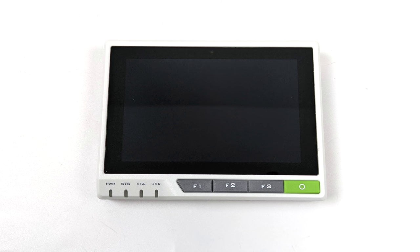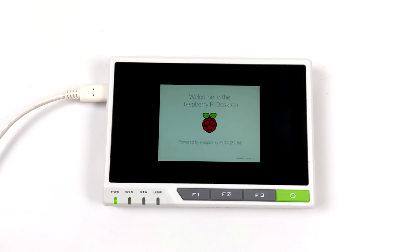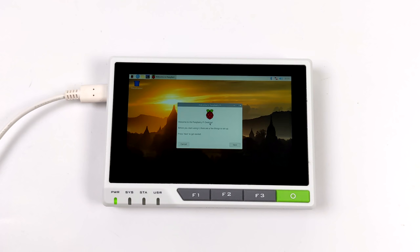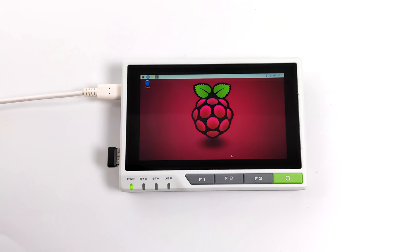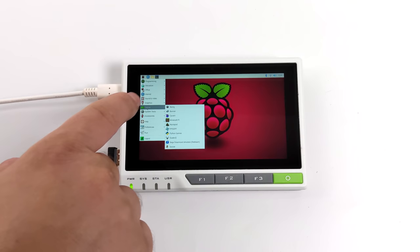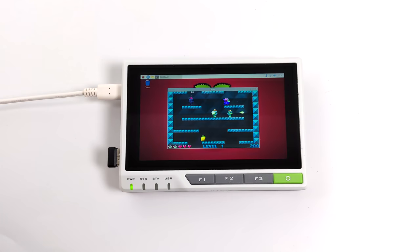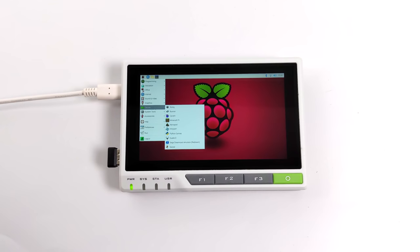On the front of the unit we have four physical buttons, and up top we also have a power button and four activity LEDs. I'm going to go ahead and boot this up for the first time using a 3-amp 5-volt power adapter — basically the standard Raspberry Pi 4 power adapter. The operating system is Raspberry Pi OS, but we can also install Ubuntu because all of the drivers that Seeed provides on their GitHub page will work with both. The touch worked right out of the box and it's actually pretty accurate for this little 5-inch screen, but we would need a bigger UI for home automation. The screen is just a bit too small to use without a mouse and keyboard. There is no sound built into the ReTerminal — there is a buzzer built in for IoT applications, but no real speakers for the operating system.